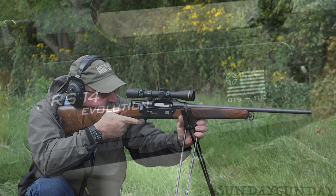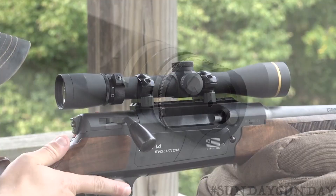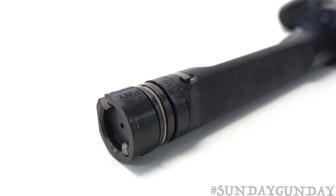The one-piece receiver is made of aluminum and includes an integral Picatinny rail for mounting optics and to ensure repeatability when changing calibers. The bolt accepts Mini, Standard, and Magnum diameter bolt faces to accommodate different cartridges. It wears a plunger, ejector, and sliding extractor, but beyond that, it is unique among bolt-action designs.